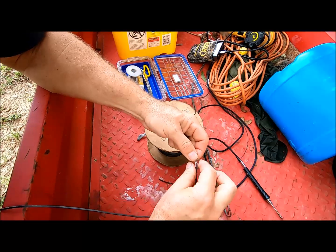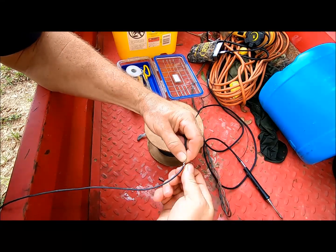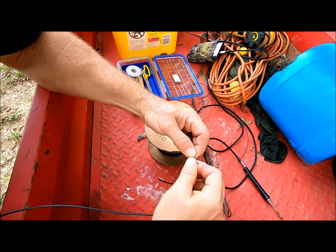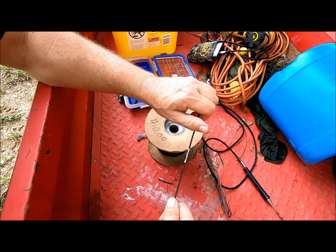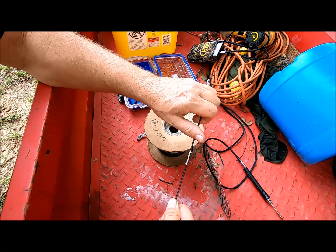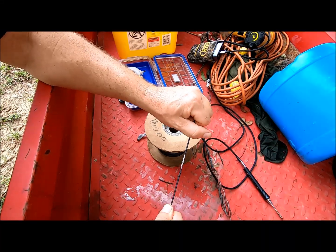Then go ahead and remove our insulation, and just take and run your tail ends around like this. If you were to use this as a field expedient wire splice, you certainly could do so, and it'll give good service — just wrap around some e-tape. I'm gonna make this more permanent, so I'm gonna flow solder across it, but you can see it's extremely strong.